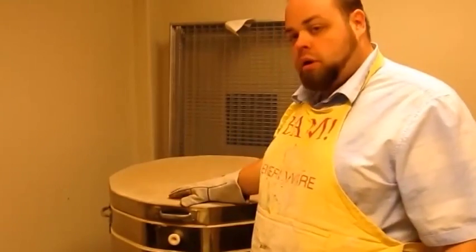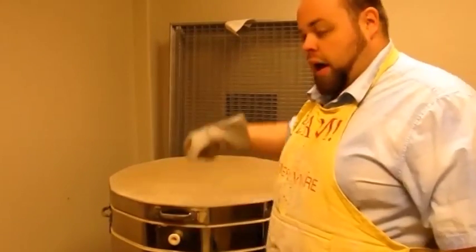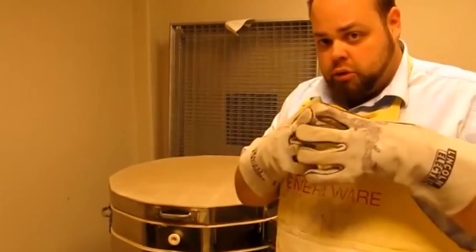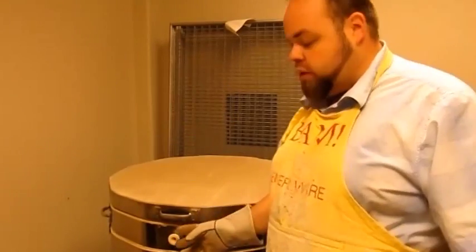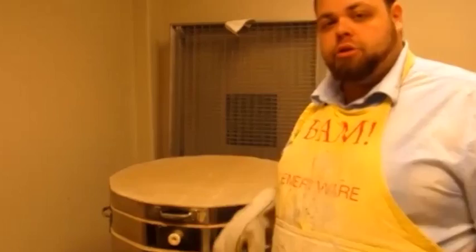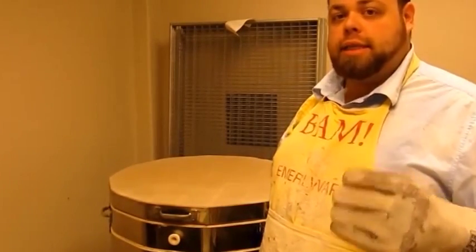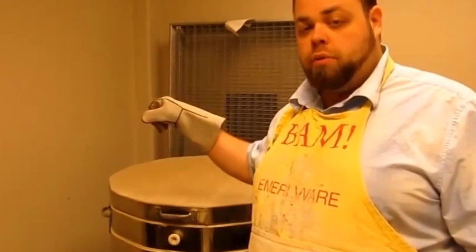Why would you need to do a burn test? If you don't have a digital readout and you don't want to open the kiln — because right now if I were to open it, my room is really cold at about 60 degrees, and all that cold air going inside would cause all the mortar holding those bricks together to shatter and hit me in the face, which could kill me. So to protect myself, I take out one of the plugs and stick the paper in to see how fast it burns. If the paper just starts to char a little and get a bit brown, that tells me the kiln is at 300 degrees or less, and I know I can safely open the lid to take the ware out without burning my fingertips or injuring the kiln.